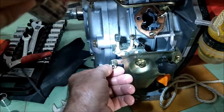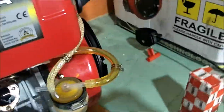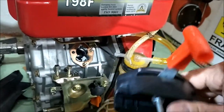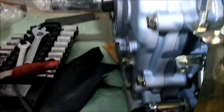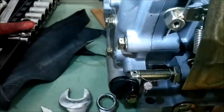Over here is a cable for an actual throttle control which I bought — this is going to be really slick because nobody with a pump boat has one of these. I went on Lazada and picked up a throttle control for a lawnmower. If I take this fixed screw out completely so it doesn't get stuck, then I run this cable end through here, down through there, and through there. Sorry for my finger — I'm having to work on the floor with the camera and everything.